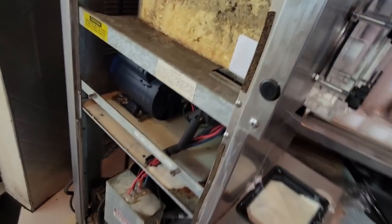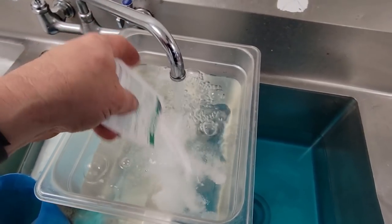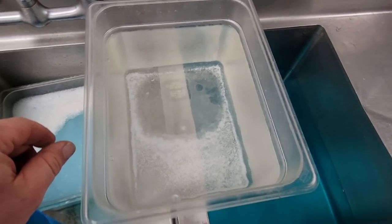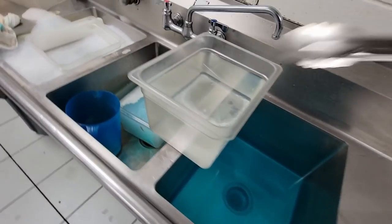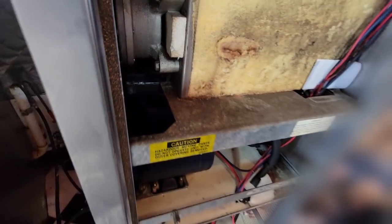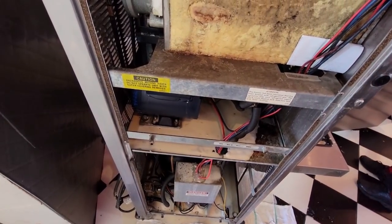Let's get the sanitizer in there and see what it does. We'll use some sanitizer here and put it in with cold water, because you're not supposed to use hot water. Hot water does a nicer job but on some machines you can take a chance of blowing the barrel out because it causes it to expand, and some of them have solenoids before and after the barrel that can cause some undesirables. Got the sanitizer in there - don't see anything coming out the back of the machine, which is kind of interesting since it didn't happen when they first did it.